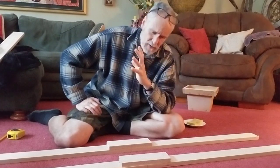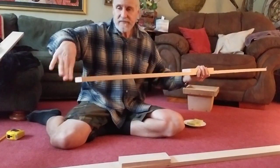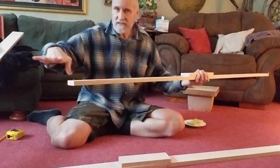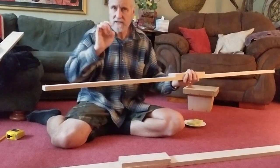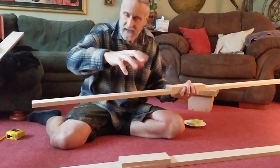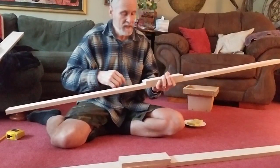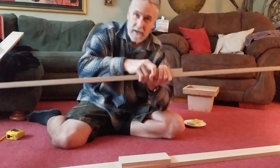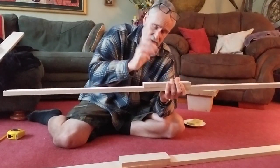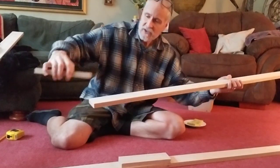What I do is arrange it when I'm looking at the growth rings. They're not straight — there's a definite orientation with curves. I arrange it so those curves mimic the back of the bow on the outside of the tree. The inside of the curve would be the inside or belly of the bow. To better match it, because I don't have access to thicker pieces, I need to glue a riser on, and I have it oriented accordingly.